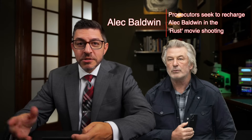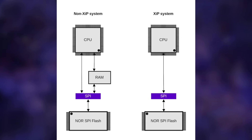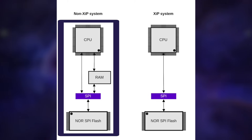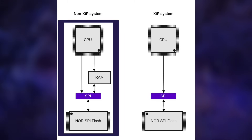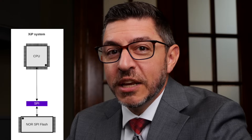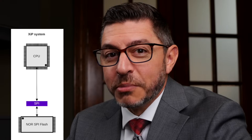In the case of memory chips, the bad thing that can happen is code might be executed from some other memory chip that you're not expecting. Some processors can boot from external memory and just run their code from there. Other processors load all the code from external memory into their own RAM and execute it there. So if the processor boots up, it loads all that code into its own internal memory and does some integrity check to verify the authenticity of the code.